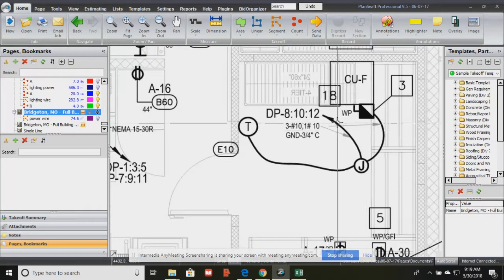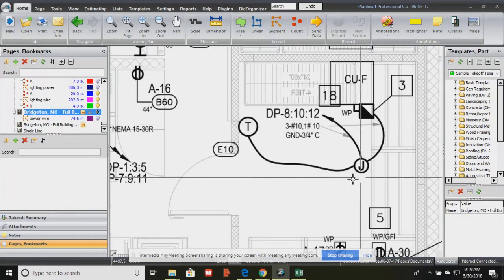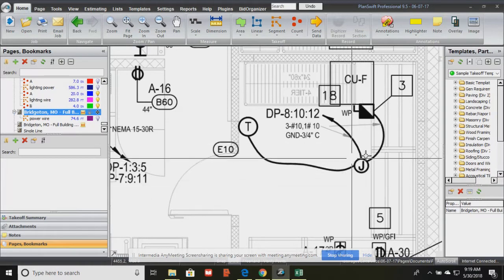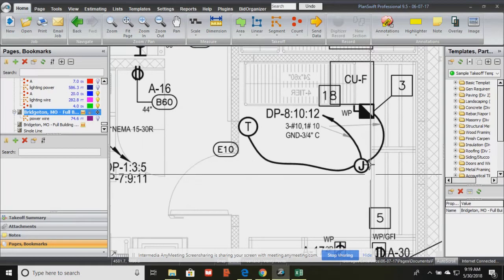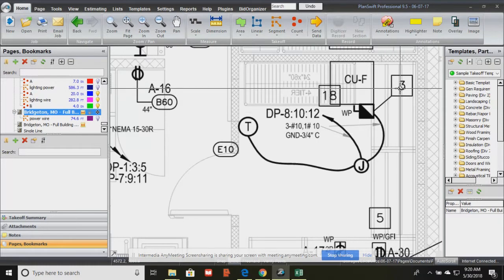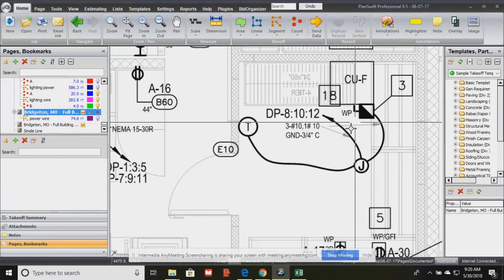A symbol that's really important is this little arrow right there. That's called a home run. Basically this junction box, and we use junction boxes to do what? To hide connections, right? So these won't be out in the open for people to mess with or for the elements to corrode or whatever. And so we've connected this condensing unit, usually used to make stuff cold or to make ice. And keynote number 3 is going to tell us all about whatever it's pointing to.